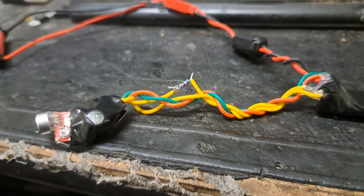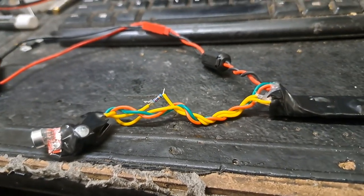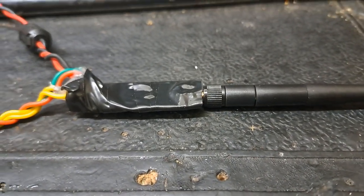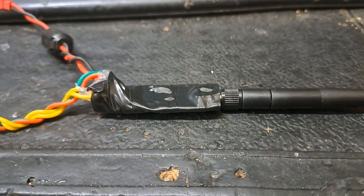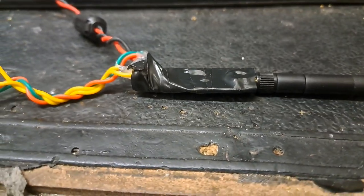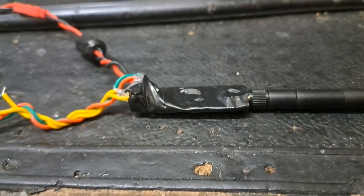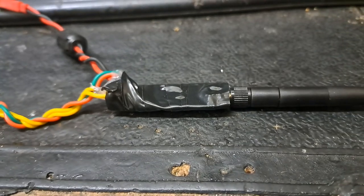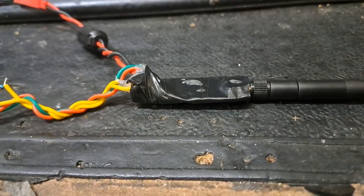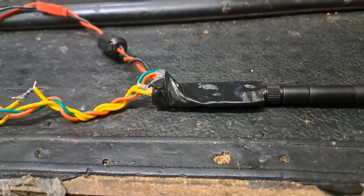Here's one of those little modules — I've got a little electret and an amp board on there. These things are real sensitive. It's like a little spy transmitter type circuit. It runs about 700 megahertz, so between 400 and 900 MHz — standard factory tuning is 700 MHz. In testing, it needed about 100 millivolt peak-to-peak input signal and it sounded great playing various tones.